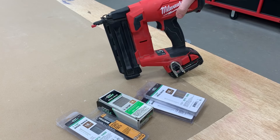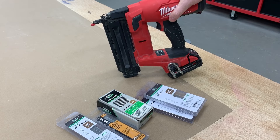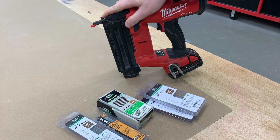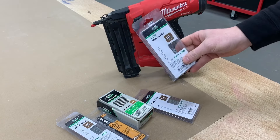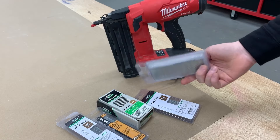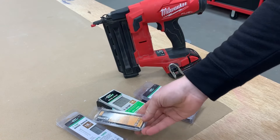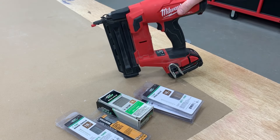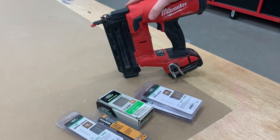I've posted about using this gun quite a bit on Instagram, and literally the only thing I've heard about this gun is that it doesn't like DeWalt nails — every time someone has an issue, that seems to be it. I've just been using the Grip Fast cheap nails from Menards and also the Bostitch 3/4-inch nails, and I have not had one single jam. So if you're having issues on any gun, just try a different nail — that could simply be the problem.